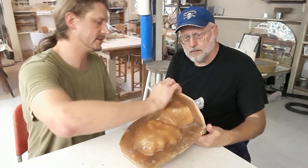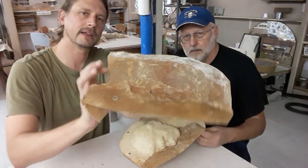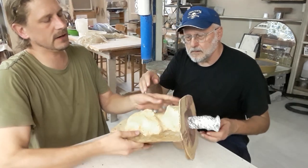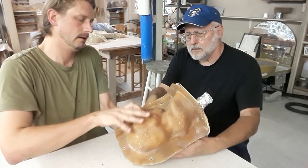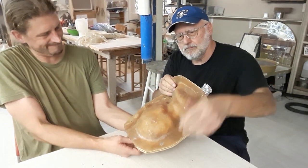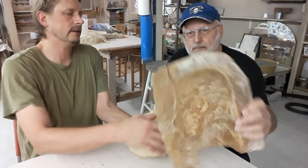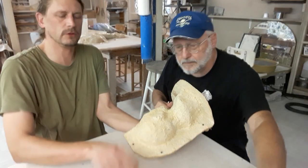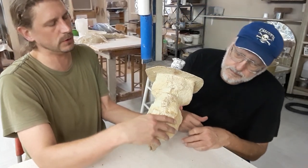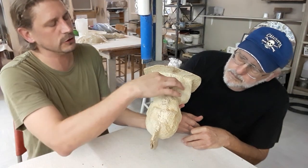What we're going to do first is pull off this side of the mother mold. That's the fiberglass piece there, and then we're going to take off the other side. That's a sign of a high-quality mold — in this particular case they made it all a one-piece mold, but made it really flexible and used that flexibility to their advantage.